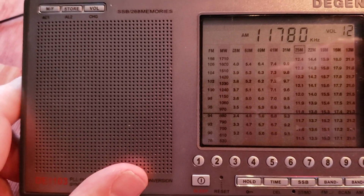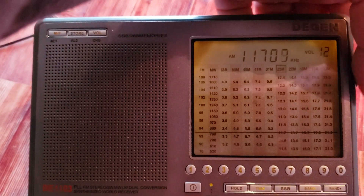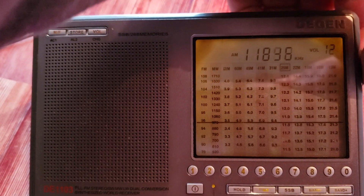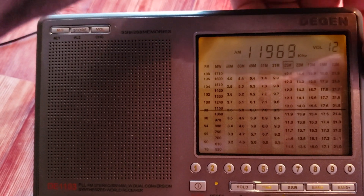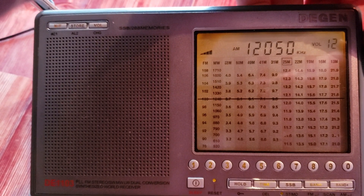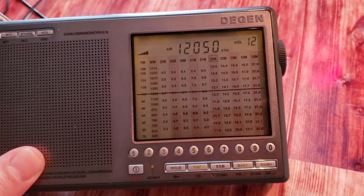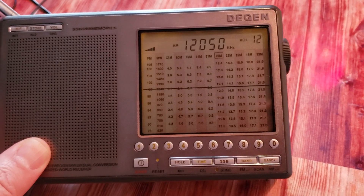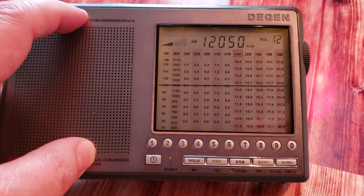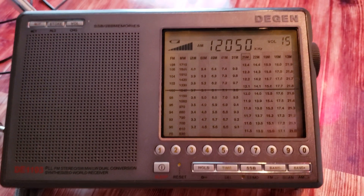It's kind of equal actually — it's better with the telescopic than with the loop. I'm having a clearer signal even though it's noisy. Let's find a signal I can actually get strong. Here we go — this is WEWN, the Catholic station. We've got this signal and we're going to try to see if we can have it better with the AN-48X.